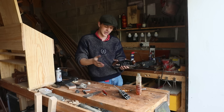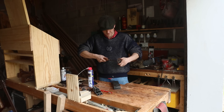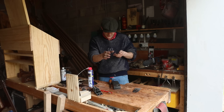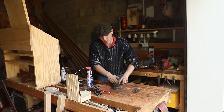I'm going to let that soak in for a while and then wipe it off, but now we need to move on and work on the blade. With everything else done, the last thing left is the iron. First we're going to separate the chip breaker from the iron itself — that popped off fairly easy. The chip breaker just needs a quick sanding to remove the light rust, but the iron itself needs the back flattened and then the edge sharpened. I've gotten to a point where I can get a fairly good edge freehand, so I'm going to lube up the diamond stone — this is 1000-grit, which I feel is as far as anyone ever needs to go for sharpening this kind of plane iron.